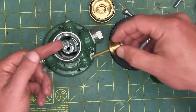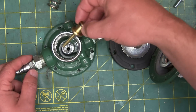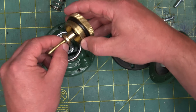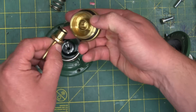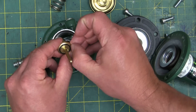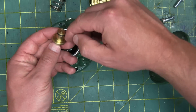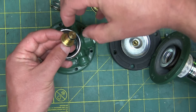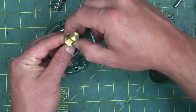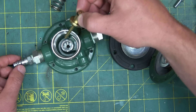When there is no pressure on the inlet, this bias spring ensures that the poppet valve is closed. There is a very small effective area, and the reason they've done all this with the Buna-N O-rings and the perfectly fitting seal here is that effective area cancels out the top side. This is completely cancelled, so all we have for area that pressure can bear on — that actually makes this seat — is a very thin ring along here. So you're not going to get a huge whack from 100 PSI to set this valve. All you're going to do is have this little effective area and this bias spring to close the valve.